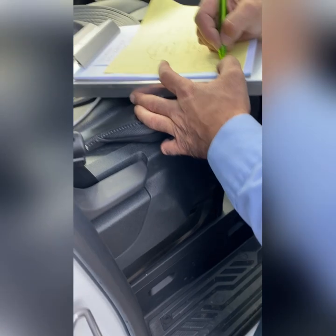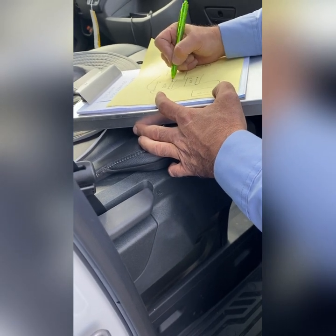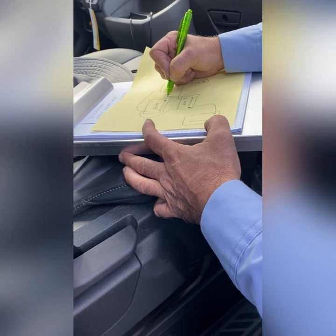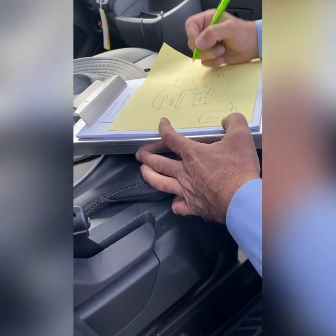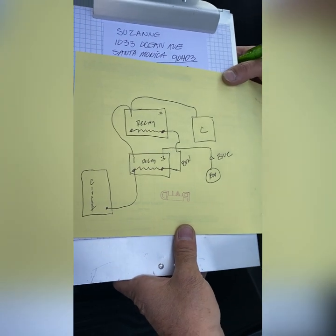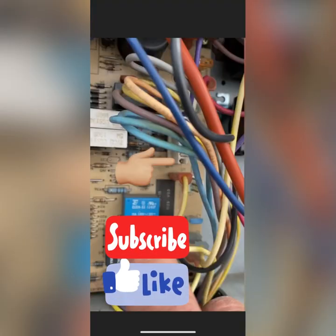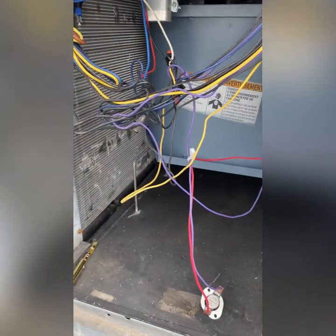White, brown, and blue wire. That's that one control that's going to go there. And then you need to put a jumper from here. That's the brown wire. So this here is a new circuit that's going to power the blower motor on heat mode. This here represents the wire that's missing on the circuit board. The relay on top is the existing one that I just moved up. The one on the bottom is the new one. The motor here got switched out.